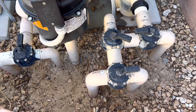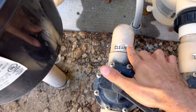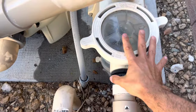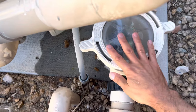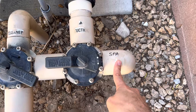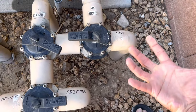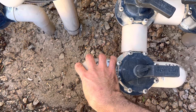Back when we were looking at the pool we were talking about water coming in and water going out. I had to label these with a sharpie because all of my stickers were starting to come off. It's easy to start by looking at the start of the pump and see what's coming in to the pump — you'll sort of know what side that is because it has this little catch here. This is water coming in from the pump. I've got my spa drain, that's the vacuum port where the pool vacuum pulls in, these are the main drains on the pool, and these are the main drains on the bottom of the spa — those circular white drains. Main drain on the bottom of the pool, and the skimmer.